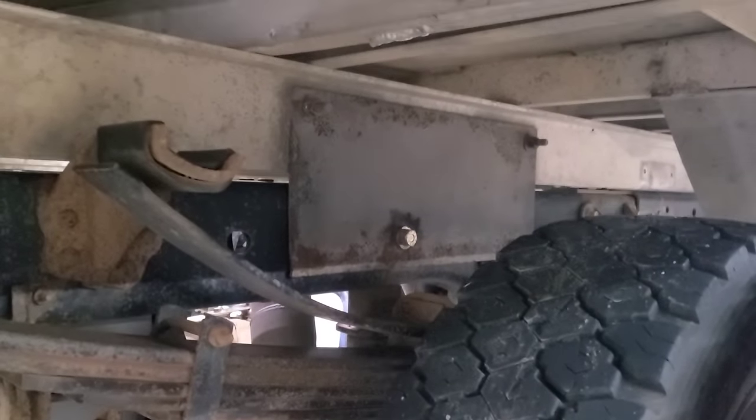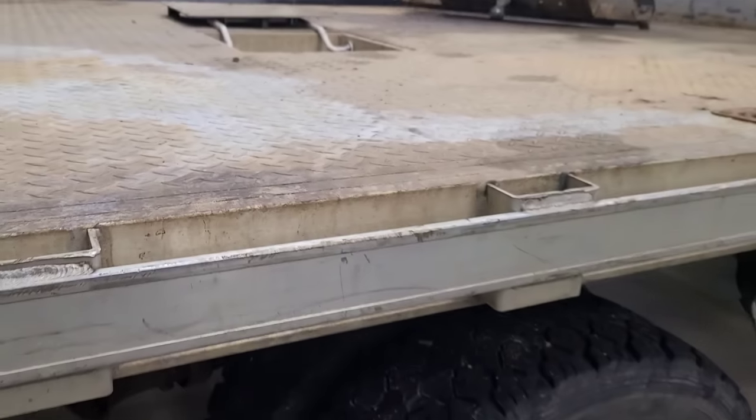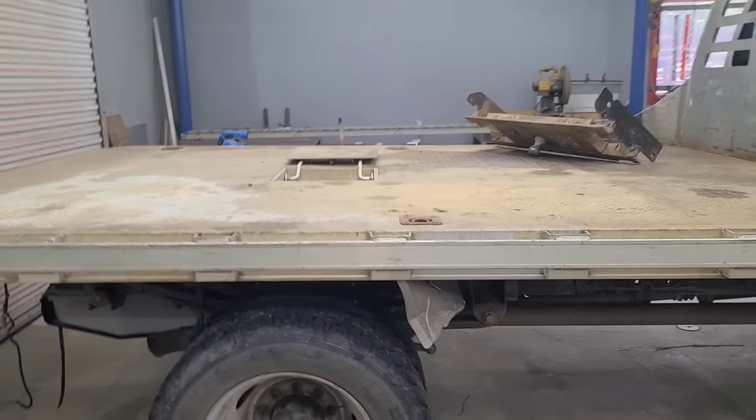See, there's a plate. If you look at the bottom right there, there's one bolt like that on each side, and that's all that's holding the bed on. And where that plate is, it's pretty much in line with where that gooseneck hitch needs to be mounted to the frame. So that plate could be incorporated into this. Anyways, first thing I'm going to do is get this elevation figured out. I talked to him yesterday about the elevation of the bed, and we don't think it would matter if the bed went up a half inch or an inch or an inch and a half, if need be. But first thing's going to be getting the elevation figured out, and we'll go from there.